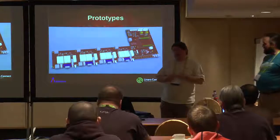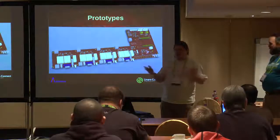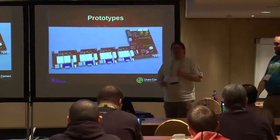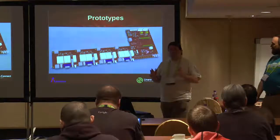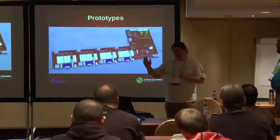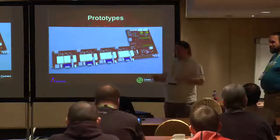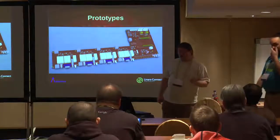But you can also read that signal, although it's only a logic input, so I'm not giving you an analog input on here, but if you need to see that you've got 12 volts present, you can use one of those lines for that. You only have 8 lines of GPIO brought out to the front. So we've not committed them as one per EUT. It's 8, do as you will. Some EUTs may need a power and a reset. Other EUTs might not need anything.